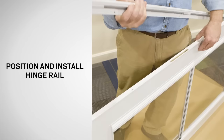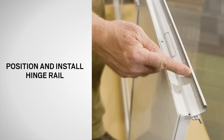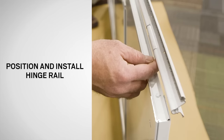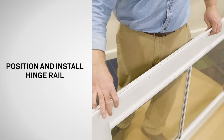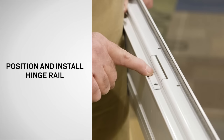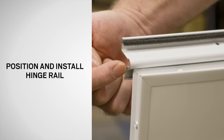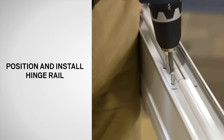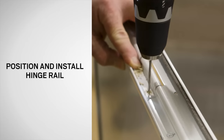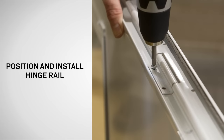Orient the hinge rail on the hinge side edge of the door, making sure the weather strip is on the interior side of the panel. For these next steps, we will be using the contents from the pink bag included with your storm door. Make sure each of the hinge leaves is resting on the edge of the door panel. Position the lower hole of the second hinge up from the bottom with the lower hole from which the screw was removed. The hinge rail should extend about 3/16 of an inch beyond the top of the door frame. Prior to drilling pilot holes, insert an unpainted screw into the pre-drilled hole. Using the 1/8 inch drill bit from the pink bag, drill pilot holes 1 inch deep in the door frame at each hinge. Then fasten using the 1 inch unpainted screws from the pink bag. Be careful not to over-tighten the screws.